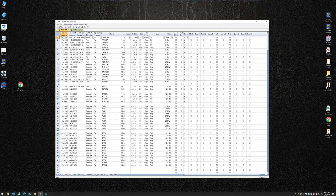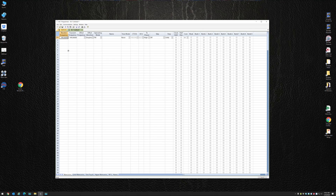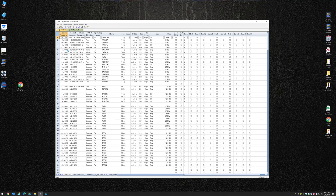I'm going to dump some memory channels into it and write it back to the radio to see if the software mod is still retained. I'll grab some frequencies to dump back into the VX7. Now I'm setting the radio back up for programming — holding the monitor key and powering it up — then going to Communications, Send Data to Radio. The radio says Clone, tells me to hit the VM key, says Clone Wait, and I hit OK. Now RT Systems is sending the data to the radio.